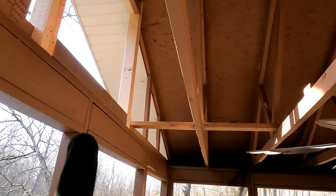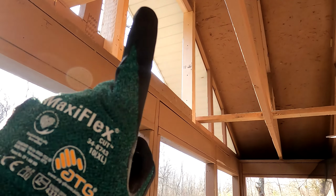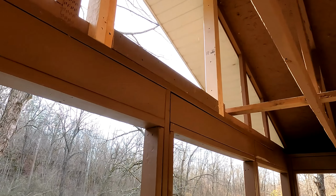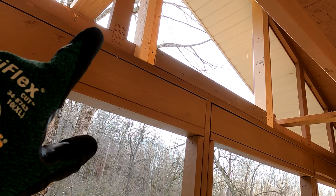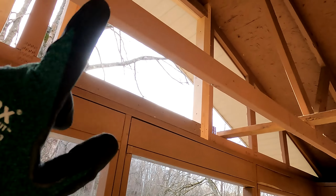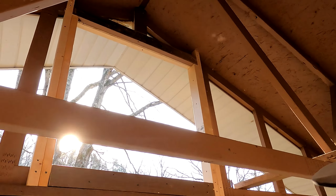And then I had the end gable support 2x4, which was bowed like crazy. So I cut it out and I framed in this window, which there was a little bit of a lip here from your end gable truss. So made that all happen. This is a 5/12 pitch. If you guys could see up there what all I did, and then frame that in.